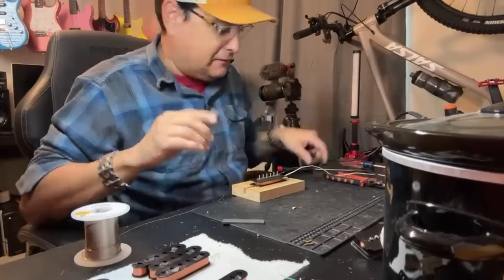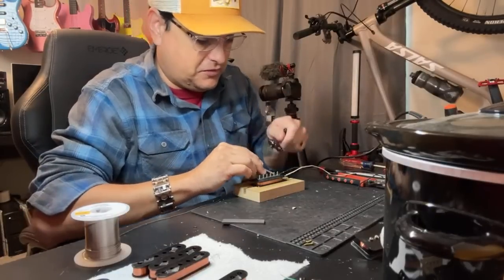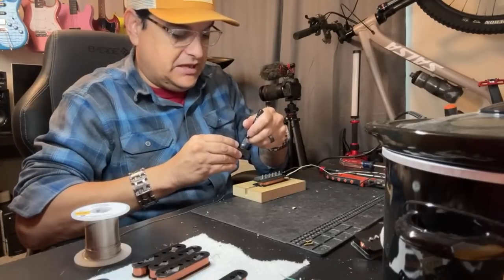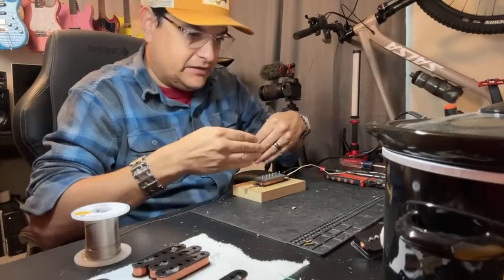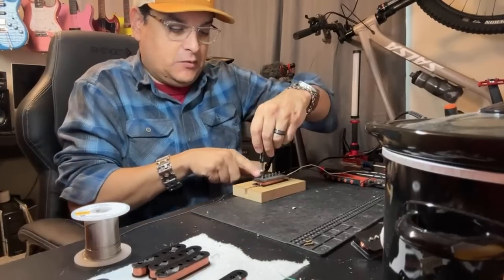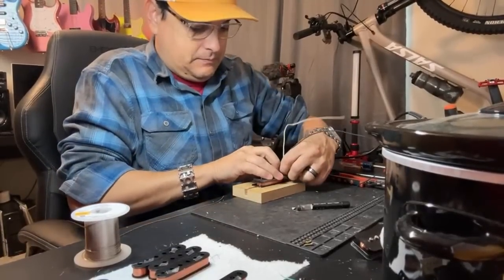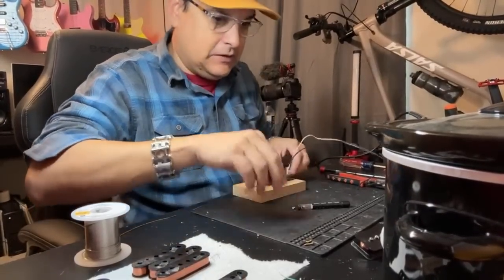Repeating the process now — this one has the wires hooked up backwards, so this is going to be our neck pickup. We're going to make this one north. You have to have the wires backwards and the magnets backwards for it to be reverse wound, reverse polarity. The pickups are actually wound the same direction, but if we wire them backwards and swap the magnets, we will be in polarity — it will not be like the Peter Green out-of-phase thing. If you flip both the magnets and the wires, you get reverse wound, reverse polarity. See — white wire is coming out of the opposite side.